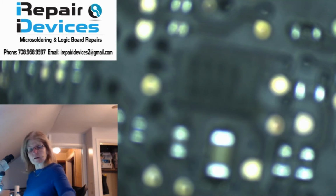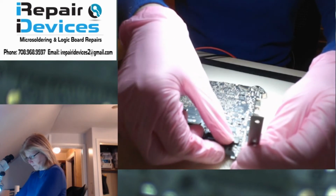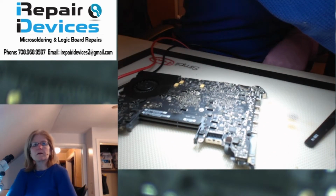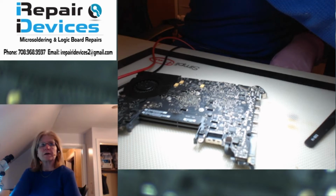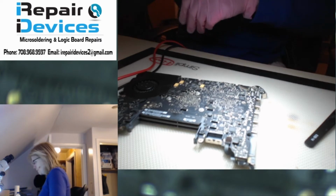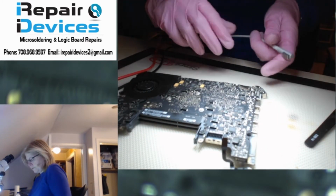See, I'll show you exactly what I am talking about. So let's flip back to my camera here, and I'm going to plug in this board. All right. Now my PP3V42 line is going to come here on this side of the resistor here. So when I plug it in, I should be getting PP3V42. All right, so let's plug in the power supply. Well, first let's unplug it, and I'll show you again that it's unplugged, and plug in the adapter here.